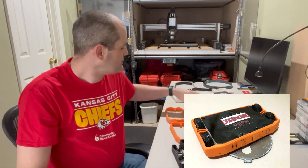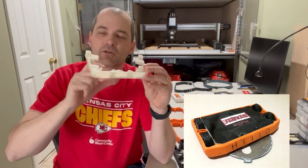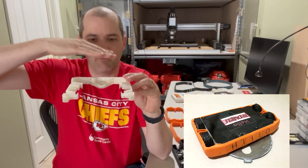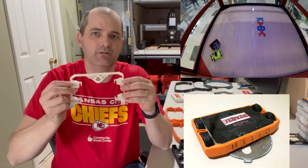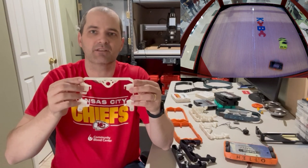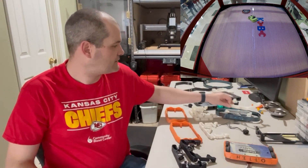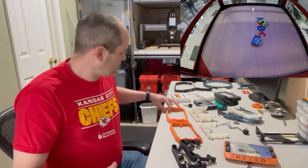I had a custom aluminum shaft made to hold the weapon, with a bushing for the bearing. But it was a very small section to hold the bearing, and over time it would start bowing, causing the blade to develop an angle. I also had problems with belt tension because the belt was always pulling it. At one recent event he could get the weapon spinning a little, but the lack of belt tension meant it couldn't get to full speed.